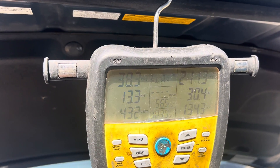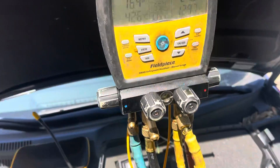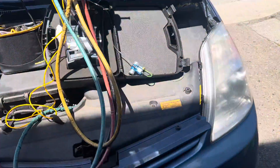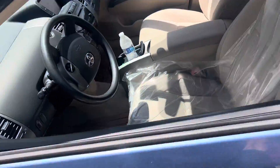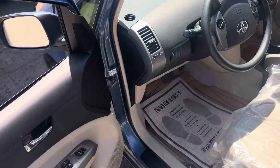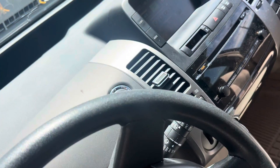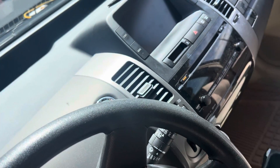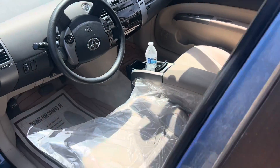I'm calling for full cooling right now and we have a cycling fan. With a cycling fan you'll never have steady numbers because it'll constantly be messing with all your pressures. So somebody trying to average something out ain't gonna work. I'm going to shut this off so I can do a recovery, measure the refrigerant, and analyze it first.